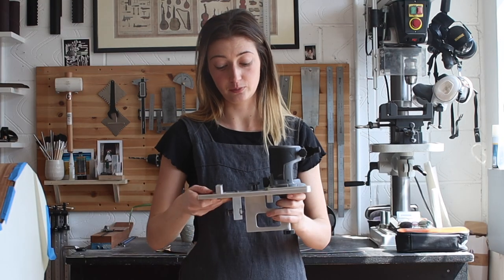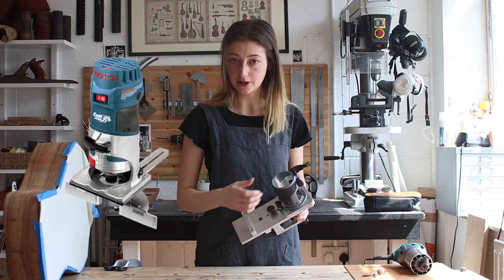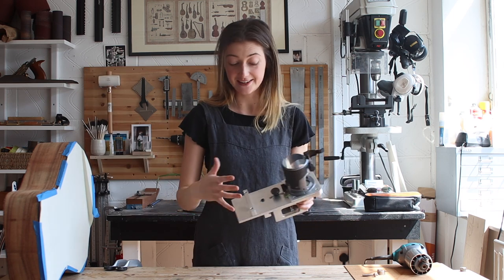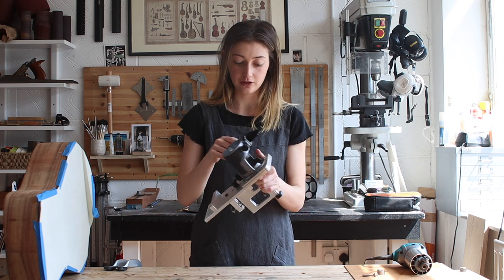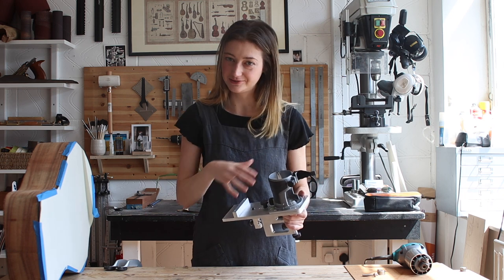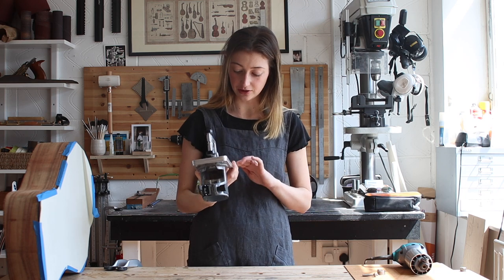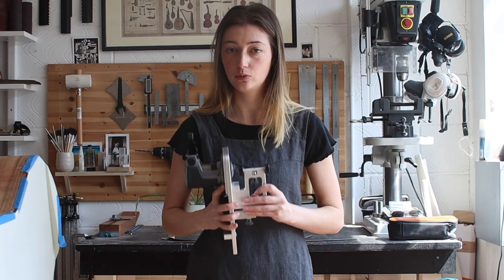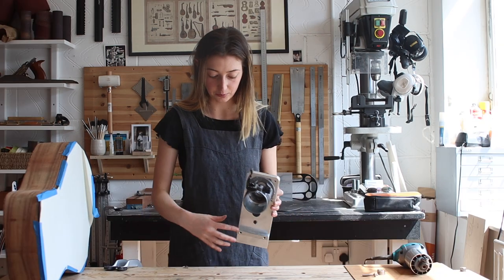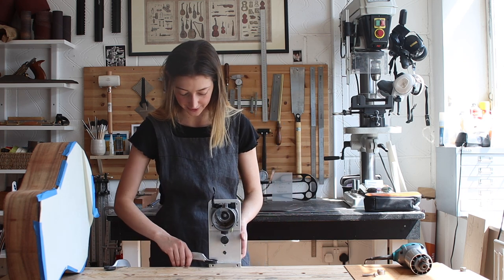Here's the entire jig — when I said it was small, I wasn't lying. Because they're out in the States they recommend using a Bosch Colt, which is what the jig fits. I couldn't get hold of one in the UK, but luckily they stock this adapter plate, which I've screwed on here, which allows me to use my English router base. It's made of machined aluminium, really nice quality. I'll show you the orientation we pop it in when we're about to route our channels. I've got my little workbench here — I'm going to pop it on the side of the bench and just use a couple of clamps to attach it.